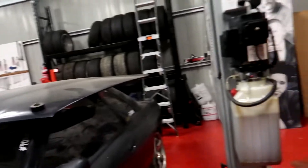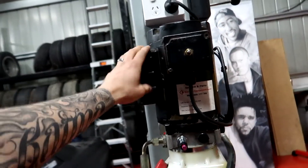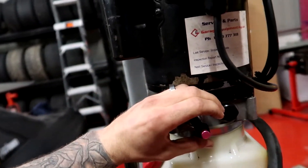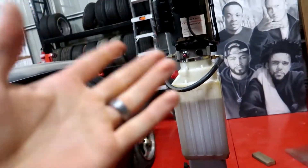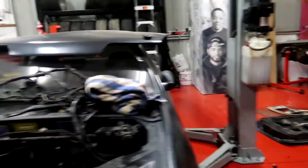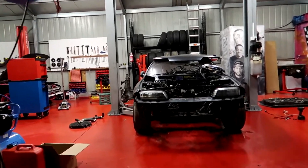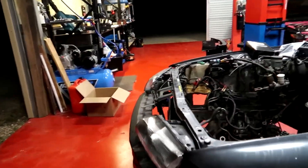It came as a three-phase hoist with all this setup, and I bought a 240V motor second-hand, set it all up. It goes up fine but it doesn't go down because there's a solenoid that's probably faulty, so I'm gonna fix that. But I can still work on it. The hoist works and it's freaking sick — there's heaps of room on each side, it's a lot bigger than the other hoist, and it's a clear-floor hoist so there's nothing on the ground.